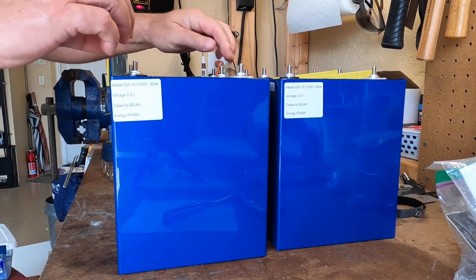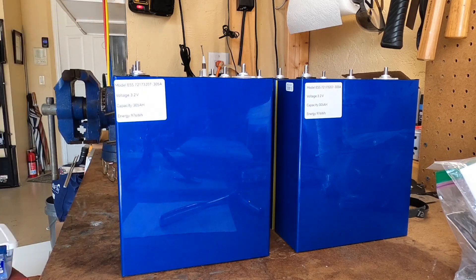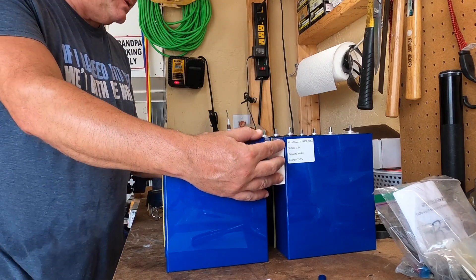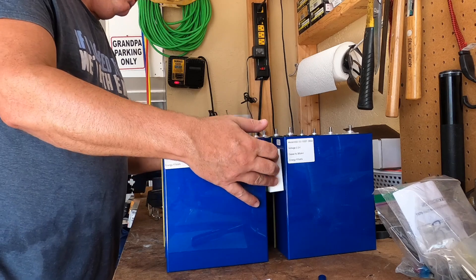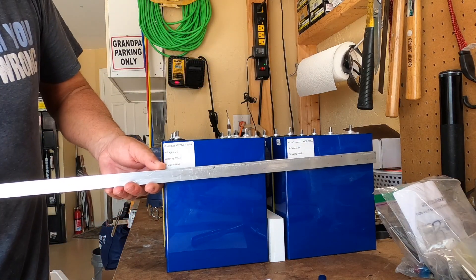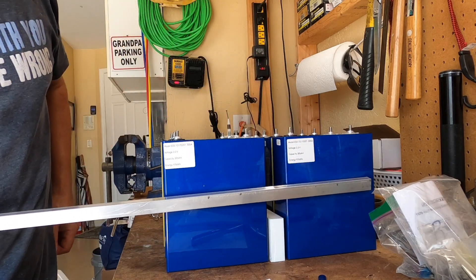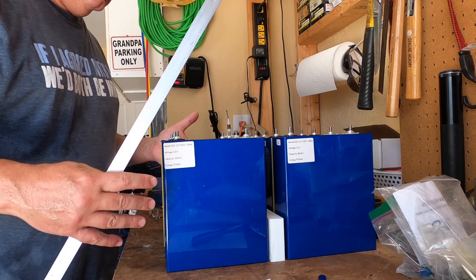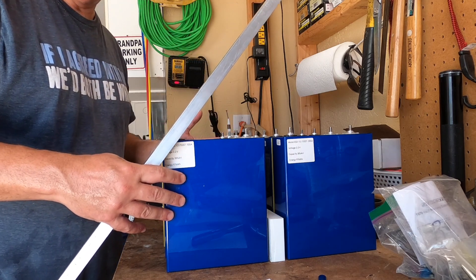Line them all up. I cut this piece to separate the batteries — just to space them and to space it properly for the connector across, but more because I like it and it's going to be a nice cradle. These will go here and here to keep the swelling from happening, and this will be cradled between two screws. Then that entire thing will be one battery pack that weighs a third as much as the equivalent in lead acid — it's pretty amazing technology, so I'm excited about it.